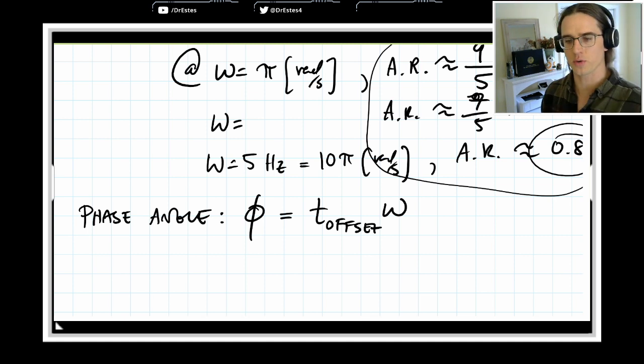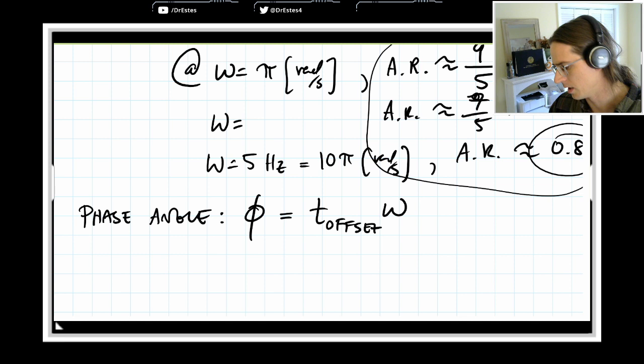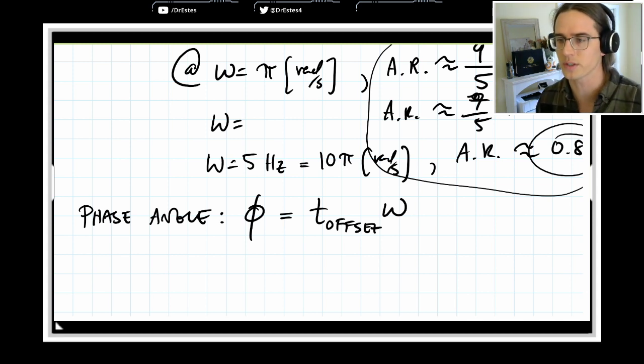That's a great question. The reason that the velocities might have different amplitudes on positive or negative, depending on the direction of rotation, could be a result of how this motor is manufactured. It could just be a manufacturing defect, like a misalignment of the rotor, perhaps. Or maybe an issue with our sampling frequency. I'm trying to get 100 samples per second, but we're not sampling so slow, so I think it's really a manufacturing defect.